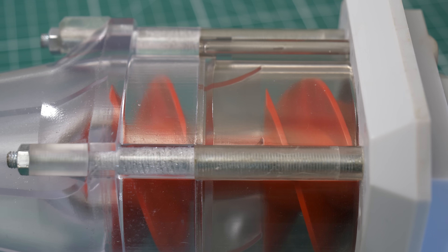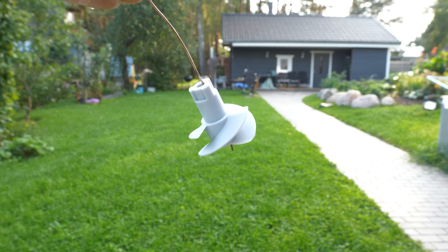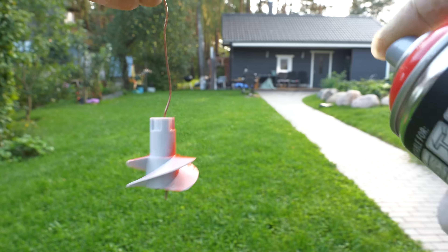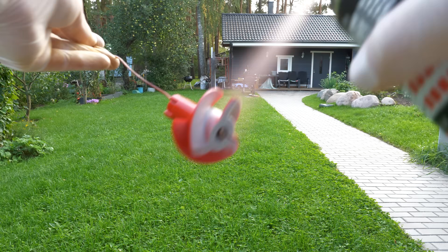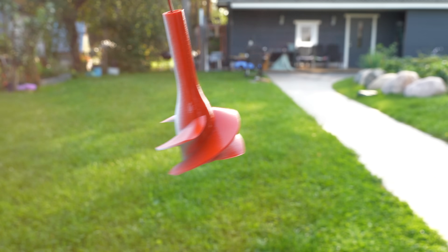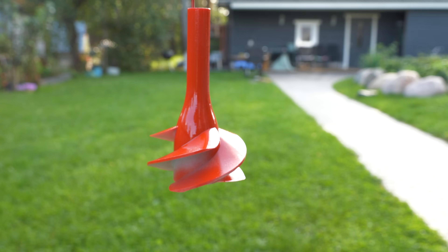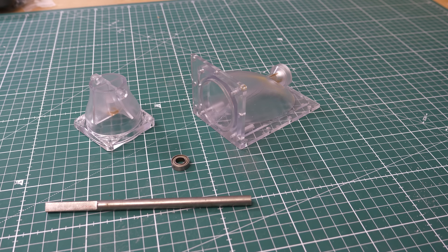The result is in front of you — I'm happy with it. It's not as clear as glass but I believe it's as close as I can get. I also painted the impellers red so we can see them better inside the transparent jet. I wanted to use the tough resin for the impellers, which is why I painted rather than mixing red resin. By the way, I didn't sand those parts — the surface finish is that good. Now with printing, painting, and clear coating done, we can start assembling the waterjets.